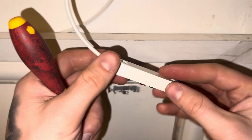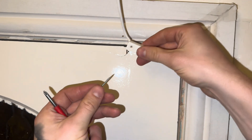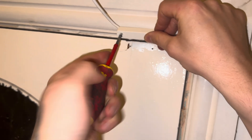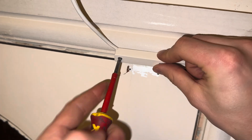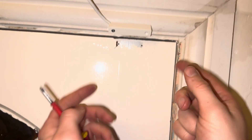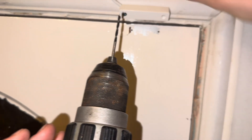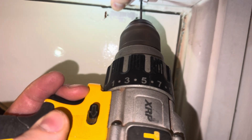Now we have the cable in place. Turn the contact round, put it into position, and using a very thin drill bit go through and make pilot holes — around 2 to 2.5 millimeters whether it's wood or metal. Once you've made your pilot hole, get your screw and a small Phillips and screw it into the architrave. I don't like drilling both holes at the same time because it's hard to get it perfectly level, so I get one screw in first, get it exactly where I want it, then drill through for the second.